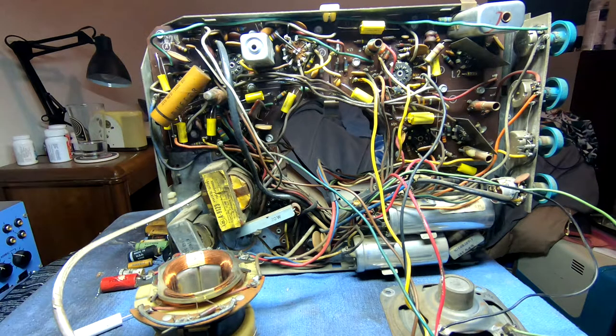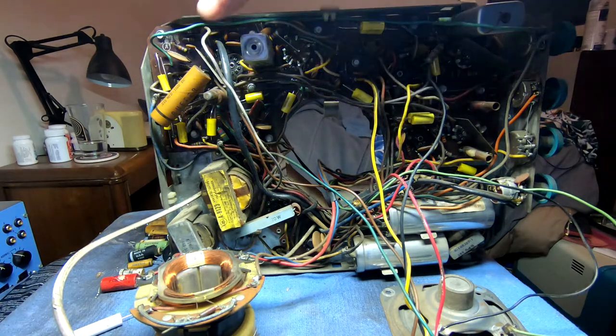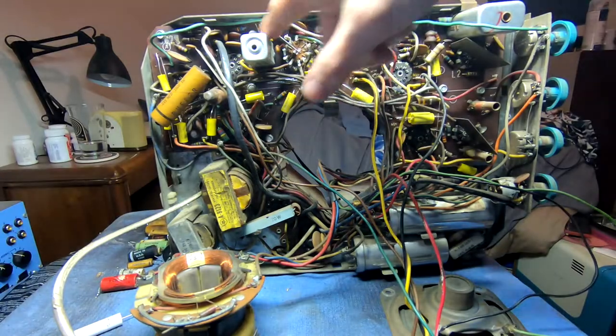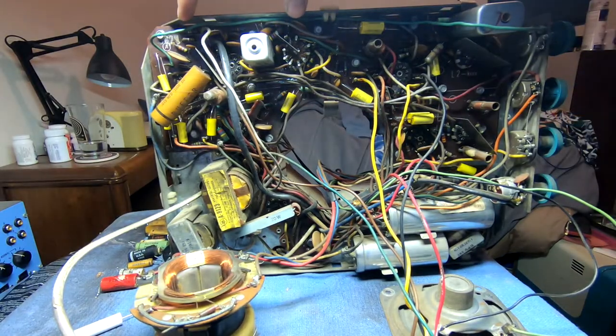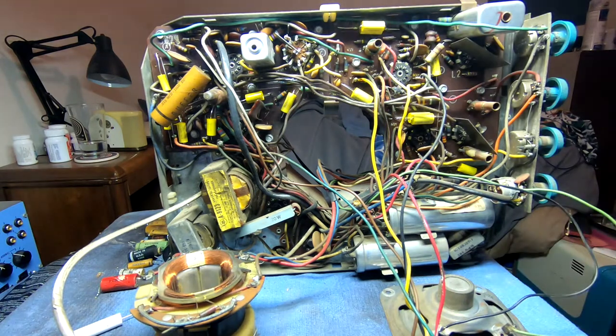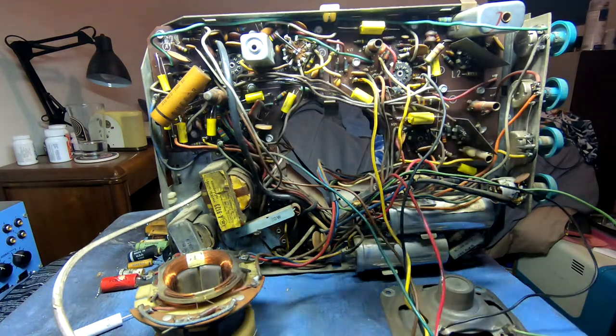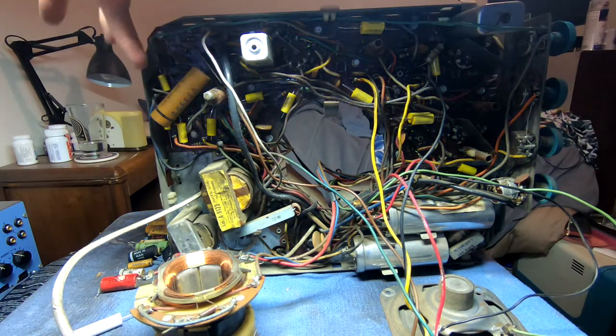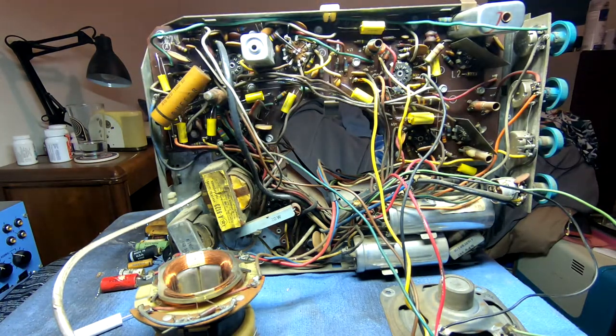I thought about filming the procedure, but it was kind of a three-handed operation. Effectively, once you take out the self-tapping screws that are located on these boards, this whole board will kind of fall out, and this whole board will kind of just fall out of it. So once I had them pulled forward enough, I could reach with my soldering iron the pads at the back of each capacitor, soften them, and then pull them forward with my forceps. So not too hard to get all of them out.